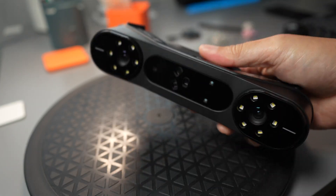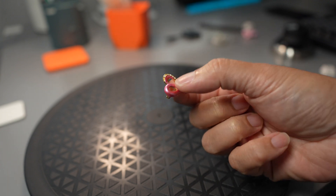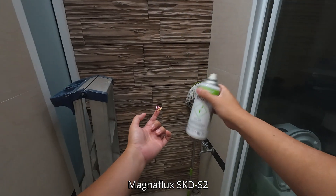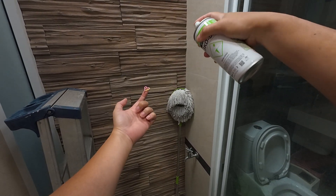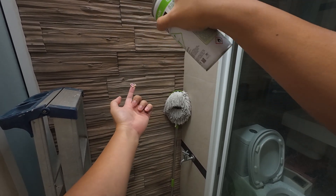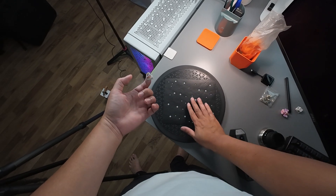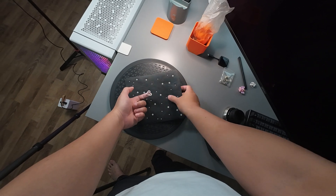This object is very small and thin and it has a metallic surface, so I'll scan the back side and also the front side, then merge it in the CRScan software. I'll use a seven-line blue laser because we need all the help we can get. The surface area is very small so I need a lot of point cloud for merging. I'll use sticker markers on a flat surface so the object is as close to the markers as possible.